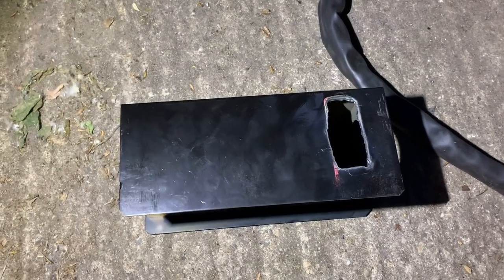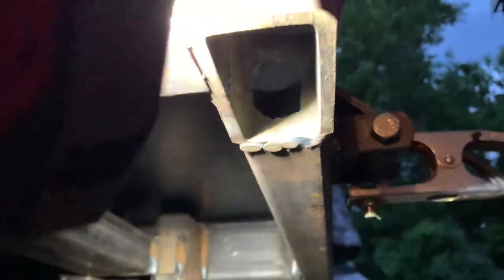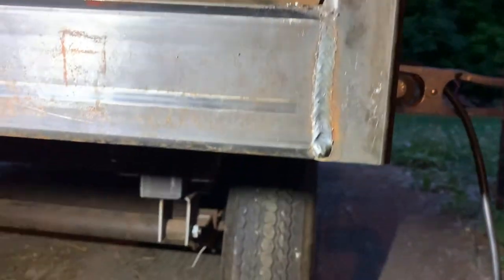Here you can see how I torched a hole in the top of these Chinese-made light boxes. I torched a hole in the frame member right here, so then I'll kind of run the wires after I weld it up here — move the wires through the tube all the way to the front. There's a hole in the front too.